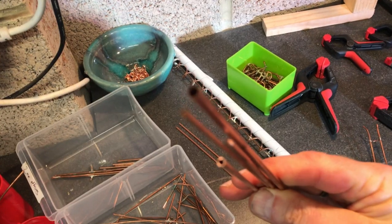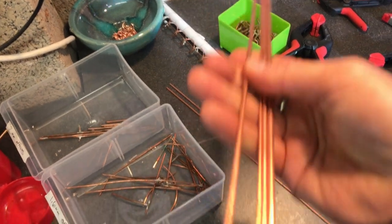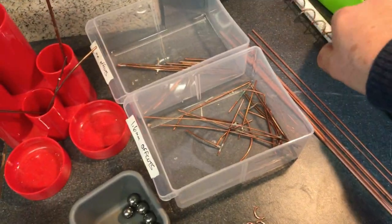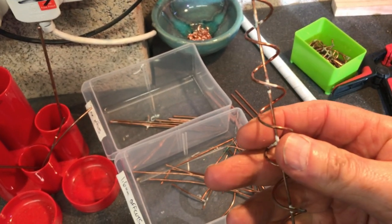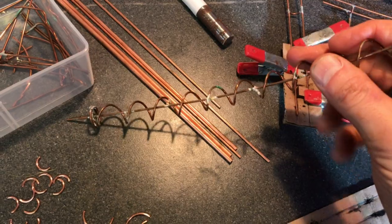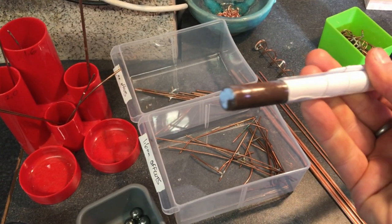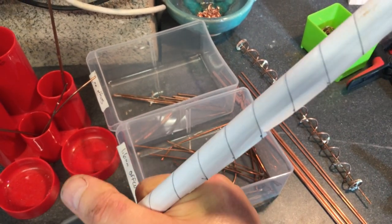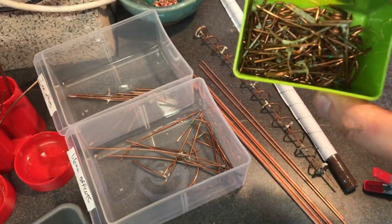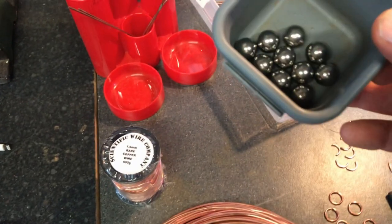Some of the hinges for the tippy tables are made from tube — with 2 millimeter, 3 millimeter, and 4 millimeter holes — so the 2mm fits in the 3mm, and the 3mm fits in the 4mm, giving you nice rotating axes. This is the prototype for the ball lift — it's not particularly central and it's quite bendy, so I didn't use it. It's made of 1.6 millimeter copper, wound around a piece of bar with paper lines drawn on to keep the spacing level. There's a scrap spool nearby for small pieces.